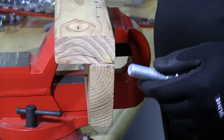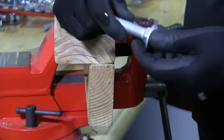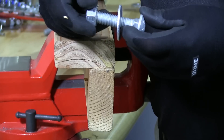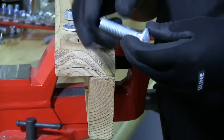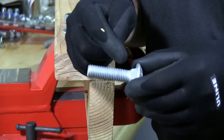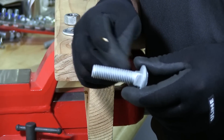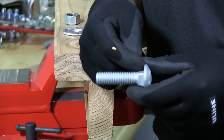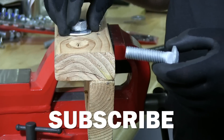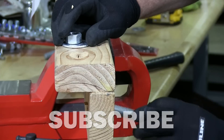I have here my carriage bolt. Carriage bolts are typically installed with the carriage bolt, a washer, and a nut to follow. You should also know that carriage bolts have a square at the top that's notched to prevent them from moving in the wood. There are no threads — threads on the carriage bolt do not run all the way up under the head, as you can see here. Once you start drawing in the nut, this will prevent it from turning.